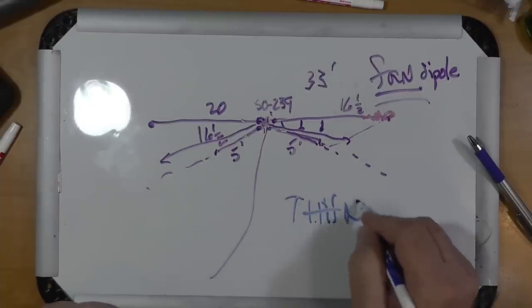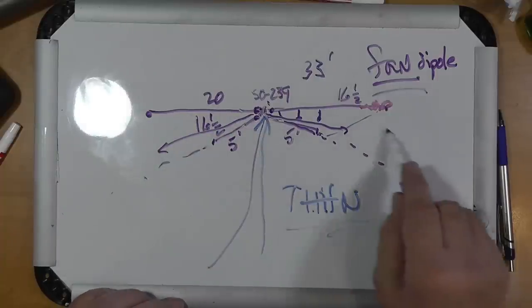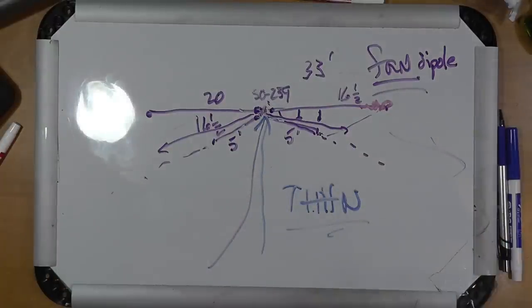THHN wire is house wiring. It's made out of soft copper and will stretch a little bit with time, so eventually you may have to take it down and readjust the length. Eventually that wire will reach the end of where it stretches and become hard copper wire — either way it conducts just fine. I hope that gives you lots of ideas of what you can do about putting antennas on the same pole. You can even put a pole here and make this whole thing an inverted V, and pull those wires away at odd angles — there's just gobs of flexibility in what you can do.